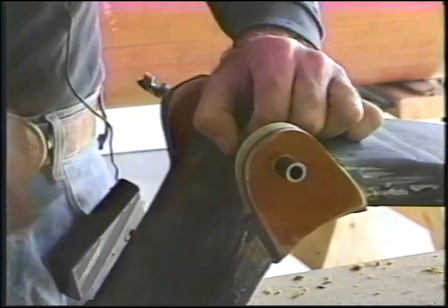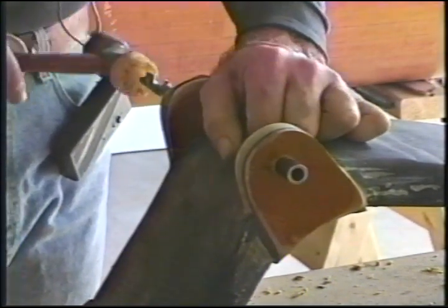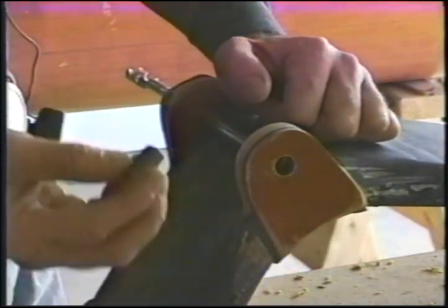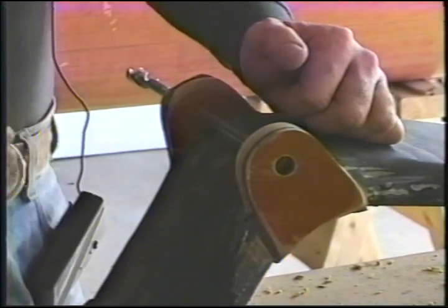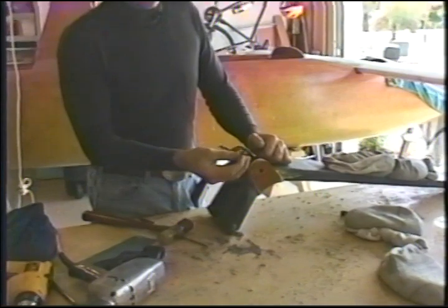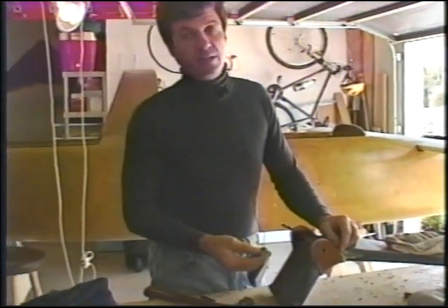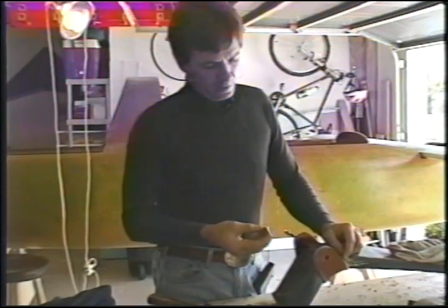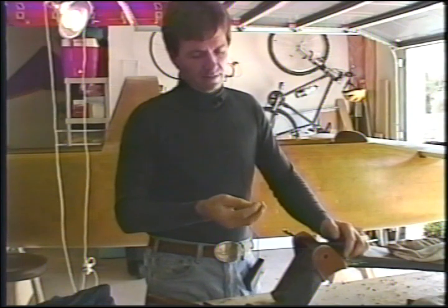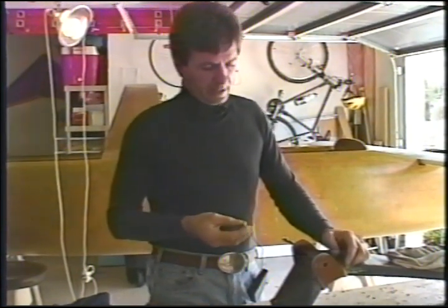I'm going to slide this out of here and give it a little bump because I need to treat this bushing yet. Sand its exterior, cover it out. You can also use West Systems epoxy or safety epoxy for the inside of the hole before installing this, covering the bushing. That will work just beautifully, and the safety epoxy would act a bit as a lubricant as you install. You have a number of different options. If I simply pressed it in place, it would be more than sufficient to handle what we're doing. It doesn't need to be bonded in place.